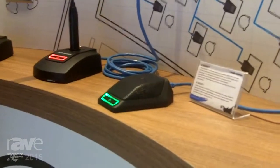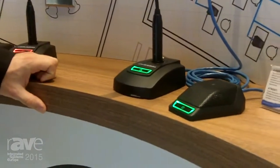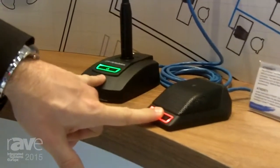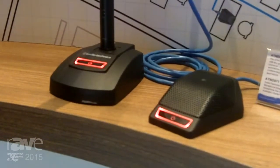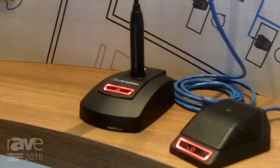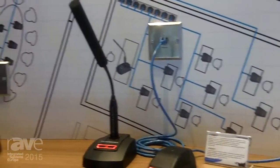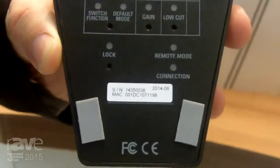In this case, all this functionality runs over the same network cable over Dante — it's embedded in the data stream, so the integrator doesn't need to worry about any additional wiring. This makes it very cost-effective, and you can create very unique and flexible solutions purely at the programming level. For example, this boundary microphone could be the chairman's mic — press and hold the button and you mute the microphone next door for as long as you hold it. That's just a simple demonstration of the functionality. The limit is really your imagination — we've even seen people make church organs out of it by playing the boundary microphone switches, which is probably not the most serious application, but since it comes free of charge embedded in the hardware, the possibilities accelerate upwards easily.